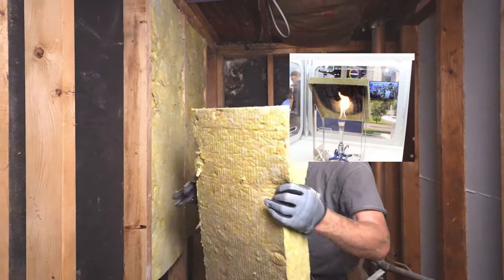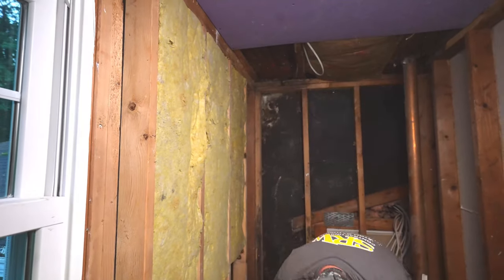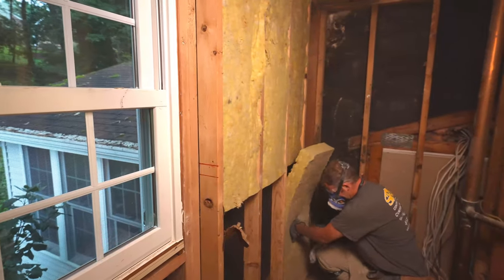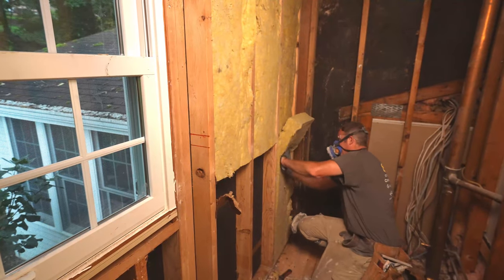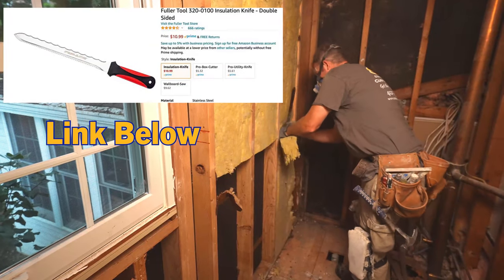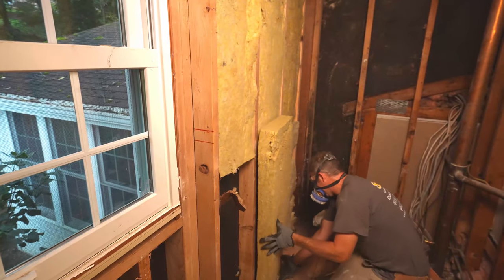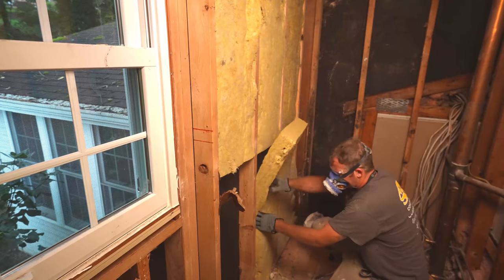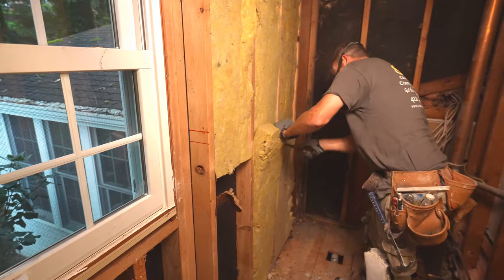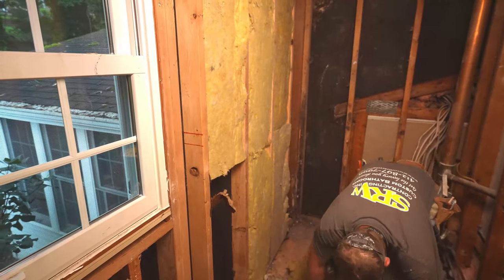It's also very fire resistant, and as far as sound quality goes, it's probably the best. I would recommend using this in your plumbing wall — if you're in a master bathroom it keeps the sound from escaping outside of that room. Just use one of these long insulation knives, which are really great for cutting it. It makes it easy to cut down because what you want to do is avoid scrunching the insulation into any cavity. It needs to be kind of loosely fit, so cutting it with a knife makes it a lot easier and puts everything into place properly.